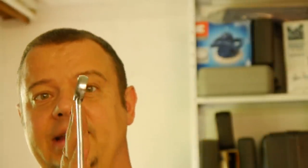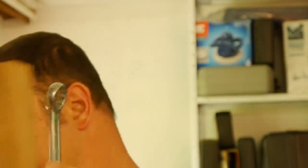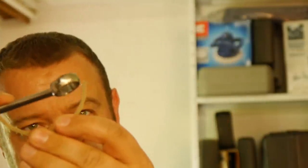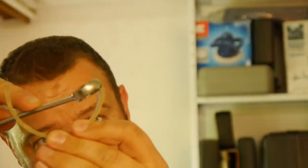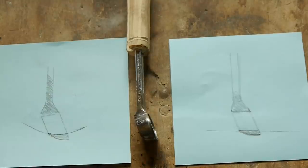Normally a wrench is slightly cranked on the ring end — this one has an angle of about 15 degrees, and normally you have angles between 10 and 15 degrees. Now you have to make your first decision: you have to decide if you want to have the cutting edge on the positive side or on the negative side. I tried out both and my feeling was that I have more advantages if the cutting edge is on the negative side. The biggest advantage is I have better access to periphery carving spots, and it feels more ergonomic. But I'm not sure if this is just a personal preference.